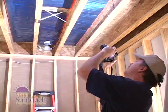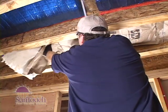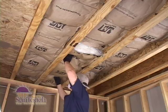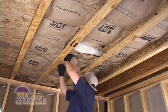Take pictures before installing insulation. Install R13 to R19 insulation below the mat. Secure it in place with rods, staples, or other methods. Refer to the manual for more details on how to install the insulation.